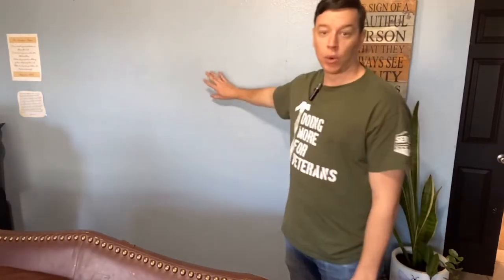So the first thing you want to do is find the wall that you want to do it on. As you find the proper location, you have to remember your vent, or your heat stack, or your smoke stack, is going to go through your ceiling and through the roof. So you've got to really pay attention to that, because you've got to be between the joists of your ceiling in order to go up through without hitting those joists. This is the wall that we're going to install it on.